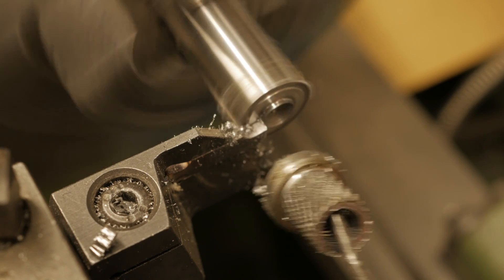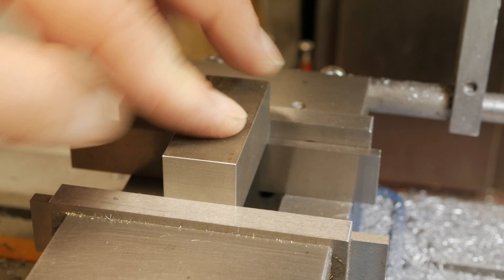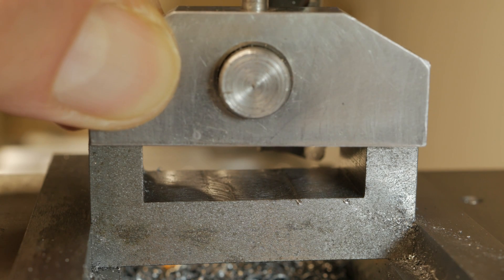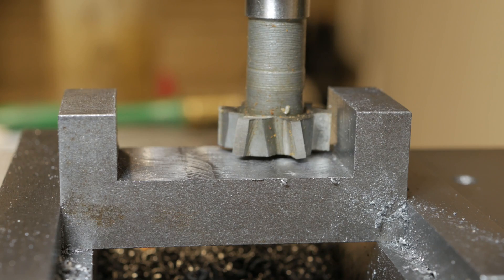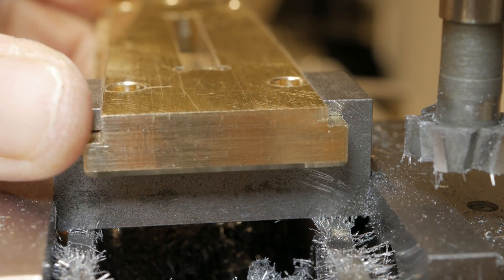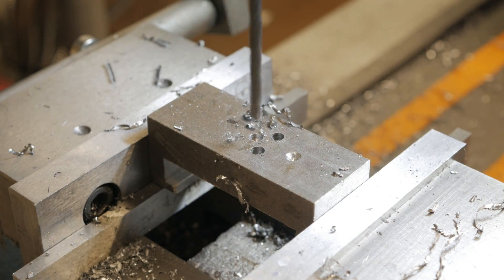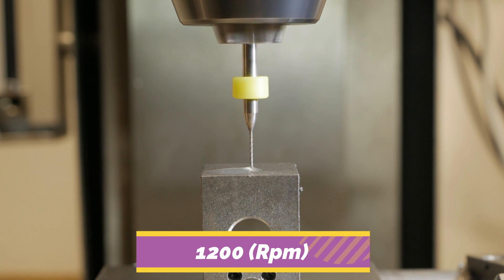In making the cursor I had to be very careful of the central passage hole in order not to find a misalignment with the punch passage slot. With my cutter it took me one hour to completely machine the cursor from solid. Each pass was 0.3mm with an end mill of 14mm in diameter, keeping the number of revolutions low in order not to generate high vibration. The use of the T-slot cutter required a low number of RPM because the side that cuts is not a point but a line, and therefore the effort is greater. I then finished the square hole by hand with my small file.